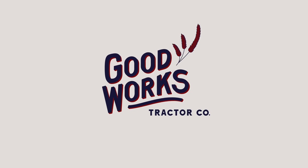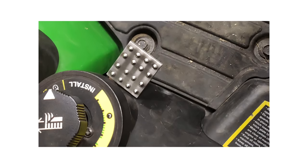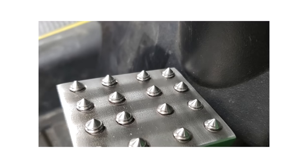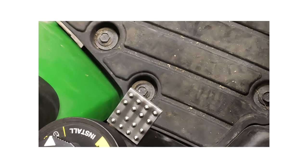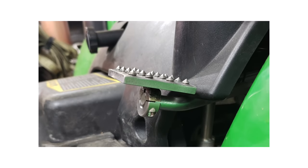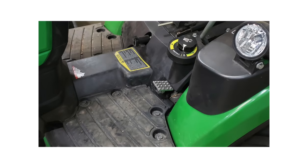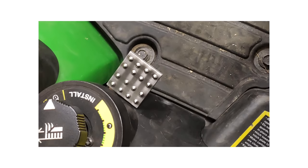Without further ado, let's jump right into this list. The first submission is from Craig. He says: 'Hey Courtney, attached is my take on a decent differential lock pedal — stainless steel plate with pointed set screws, welded underneath, attached with a split collar. Works great!' It looks like a substantial steel plate — quarter inch, maybe five-sixteenths. Those set screws remind me of track spikes, obviously much less pointy but providing grip. Great solution: grip for your heel, no chance of bending. I'll guess most of the fab time came from drilling holes for those set screws.